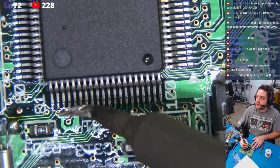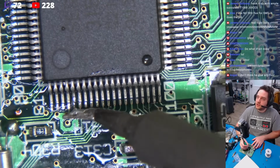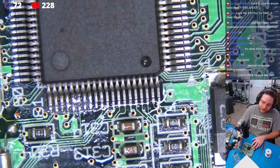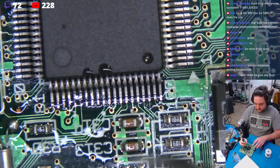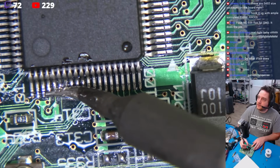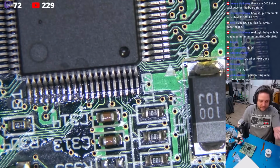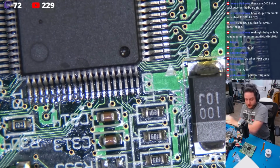Let's just make a few passes here. We know where we're going with this ultimately. Let's just come in here. Just touch. It's okay. Don't care if it bridges. Now I want to go with the fillets first, so we're going to touch the fillets. I'm going to come across. Don't care how this looks. It's not really important. It's not the point of this exercise. Now, what I'm then going to do is change out my fluxes because I hate that no clean.